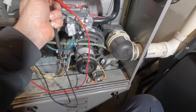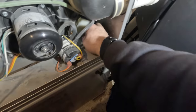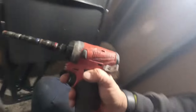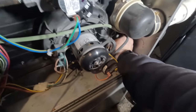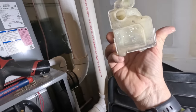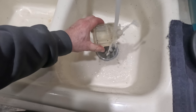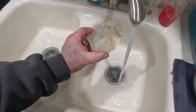Now I'm going to go ahead and clean the condensate trap anyway, because they're always getting plugged up. They said they just replaced the air filter. Let's go ahead and get the trap out of there. I literally have no room between this and the wall. Oh wow — look at all that crap in there. It's got some Mylanta-looking buildup on there.